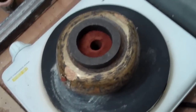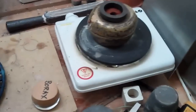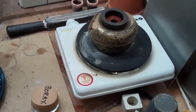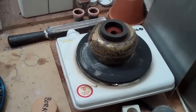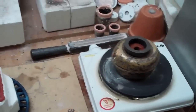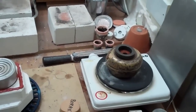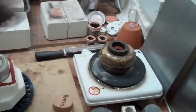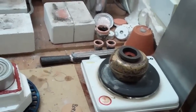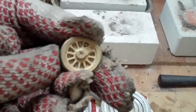This is our wheel, and the reason that we're going to warm it up — sand moulds aren't normally warmed up — but we're warming it up because we've got a very small amount of metal relatively speaking. 55 grams of bronze is all we've got; all our crucible will hold, and that's a small mass compared with the mould. The metal will tend to solidify before it's actually filled the details.